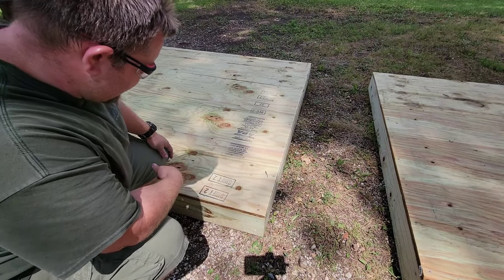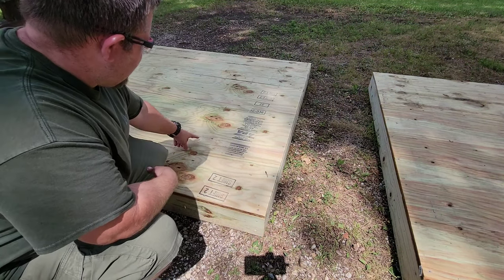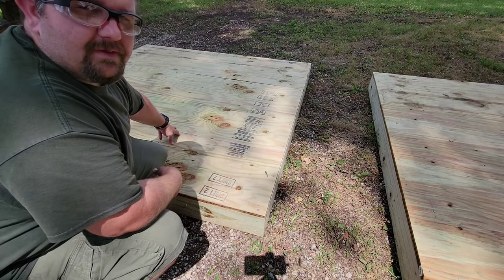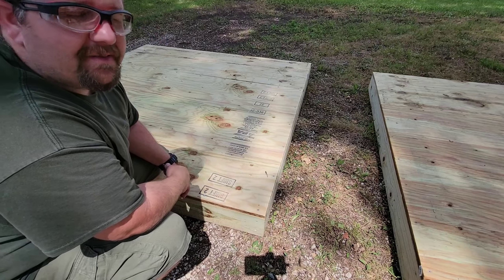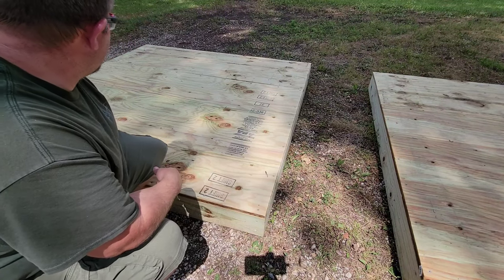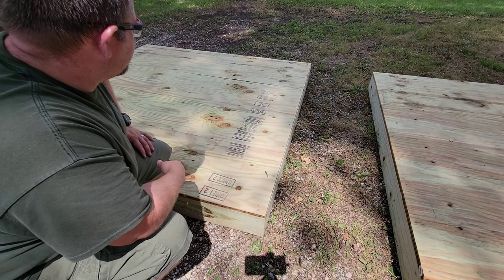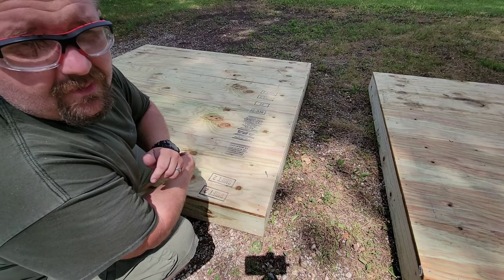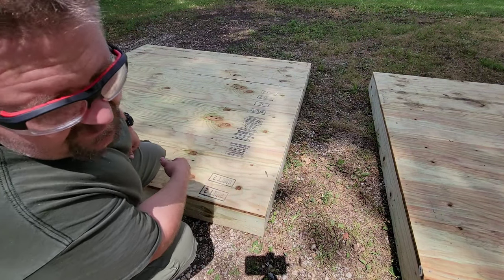After what feels like 30 seconds of video, I've finally got the plywood sheets on. Use chalk lines and your screw holes on the end to line up where your screws need to go — makes life a lot easier. Around the perimeter, space screws about 10 inches apart — roughly the length of my impact driver. In the center, go to about a foot of spacing. Now we're going to flip it over and get to the part that's going to save you a boatload of money.